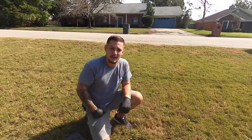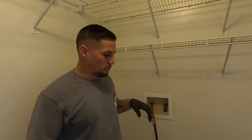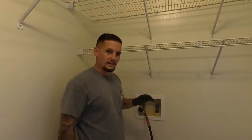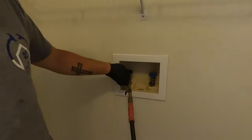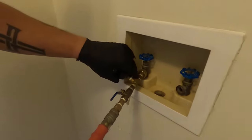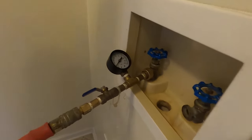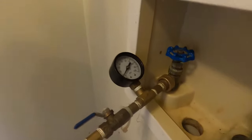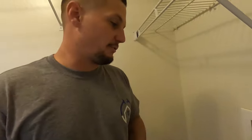We're going to head into the house now and find the washer hookups. Aside from the pressure test, what you utilize the air compressor for is you want to go ahead and hook it up into the water line. What you're going to be doing is pumping air into these water lines and walking around to the different faucets throughout the house, opening them up, and blowing out the water lines — so that when you're done there's no remaining water in the water lines heading into winter to cause potential freeze damage.